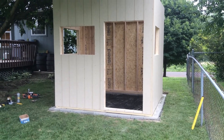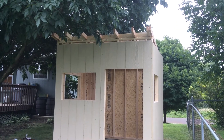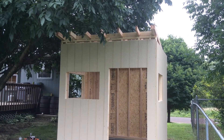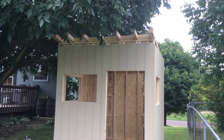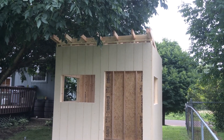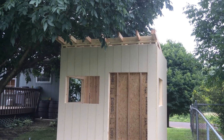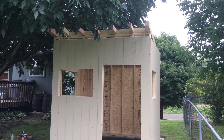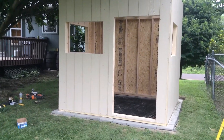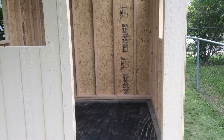Hey everybody, I'm back with you for another quick update. I got the roof joists — or trusses if you will — in place. They're all bracketed and hangered in place. All the bird blocking is in place, and that's all going to be covered up once I get a little bit of z-metal up there and run the sheeting up to clean everything up. So it's still just kind of roughed in. I'm going to walk you inside here and give you a quick look at the interior structure.